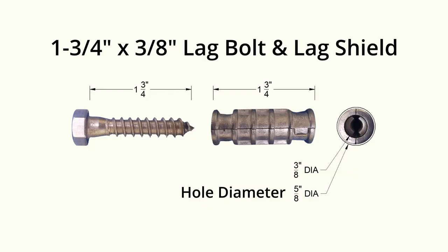I used one and three-quarter inch long, three-eighths inch diameter lag bolts and lag shields. The lag shields available at my local Lowe's and Home Depot were longer than I wanted, and I also wanted stainless steel hardware that would not rust. I ordered the hardware from boltdepot.com and got exactly what I wanted. I'm a big fan of Bolt Depot — they have every imaginable type of fastener, every size, every thread type, many available in stainless. Their prices are good and they don't kill you on shipping. I put a link below.